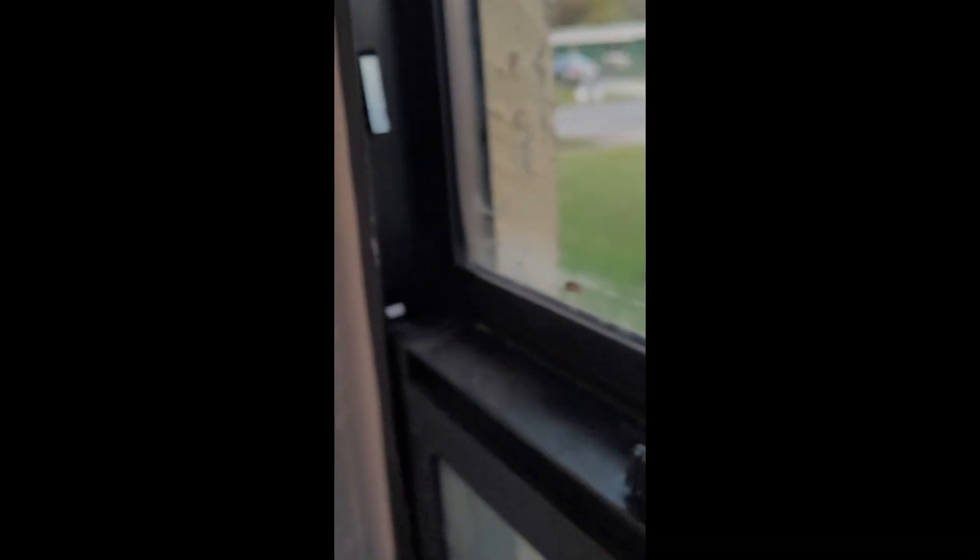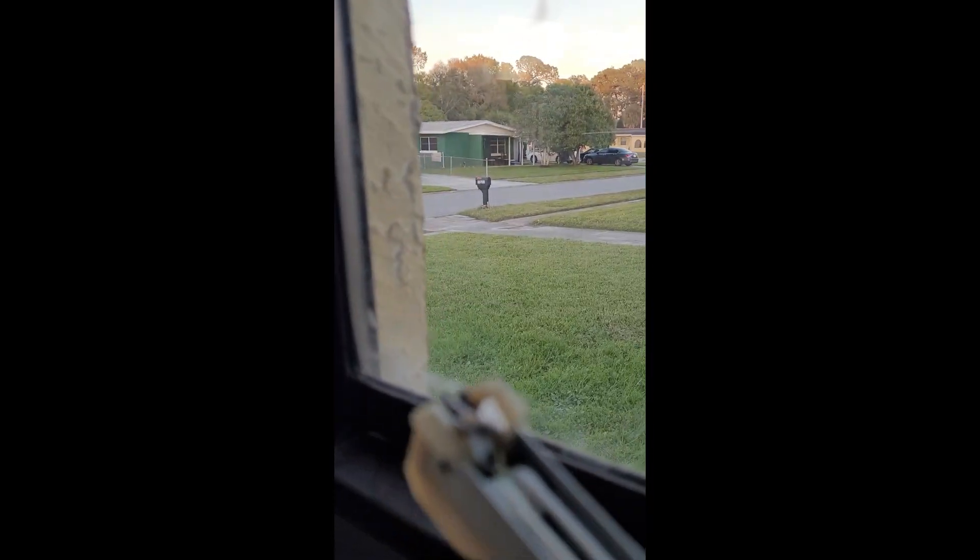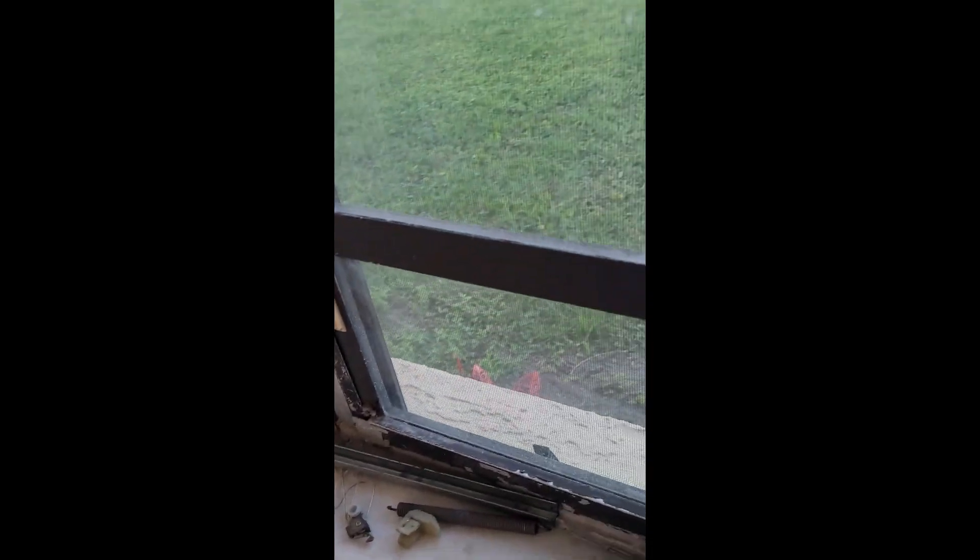When you're putting the channel balance in, you've got to take this part here. This clip will catch the top of this guy — he fits right inside the top of that groove right in there and holds the channel balance in place while you're pushing the window up and over on top of it. This one goes on one side and you'll have another on the other side. After you clip the bottom — there's a little hook — it latches in. You can see that hole; it's latched in there now. All this clip does is hold it in place while you're trying to get the window in.